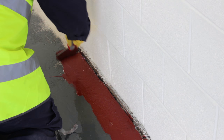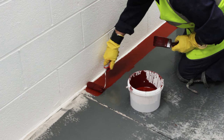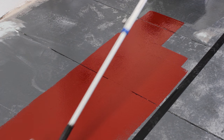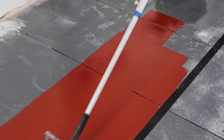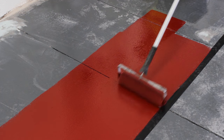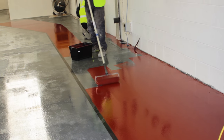Using a paintbrush and small roller, they set to work painting the edges, corners, and hard to reach spots of the walkway. Then using a wide short pile roller attached to an extension handle, they applied the remaining paint in one thick even coating, working it into the surface with long even parallel strokes. The high build formulation of the paint ensured a good film thickness, so one coat was sufficient.